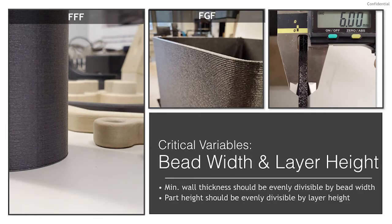We're going to start with bead width and layer height. An accurate bead width and layer height is what's most important for dimensional accuracy. The machines we develop incorporate robust industrial gantry systems that demonstrate excellent precision and repeatability. What will really dictate the part dimensions and tolerance is how accurately the operator can dial into the critical variables. With open source machines and materials, one of the most common problems with achieving tight tolerances is not matching up the proper bead width and layer height to the wall thickness and the height of the part. It's important to make sure your bead width is smaller than the minimum wall thickness of your part. If you attempt to print with a 1mm nozzle and your minimum wall thickness is 0.4mm — smaller than your nozzle diameter — you run the risk of the toolpath missing this section completely. The software available today is not intelligent enough to alert the operator of this mistake.